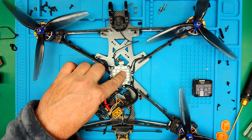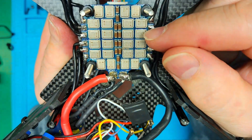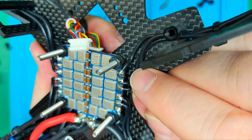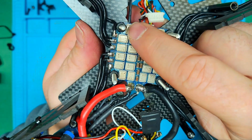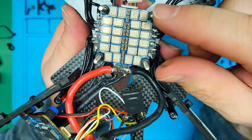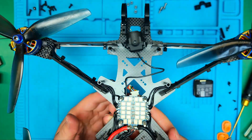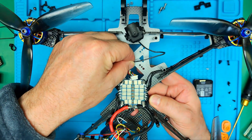I removed the flight controller from the ESC so we could unscrew these nuts and then lift up the ESC. It's a 60 amp ESC. As you can see, there are plastic nuts and that helps isolate vibrations. I have a metal nut underneath that just secures the screw to the frame, then the ESC over it, and then I put plastic nuts on top. I don't want metal nuts because they're very close to the FETs and I don't want them digging in or damaging them. So I opted to go with plastic nuts securing this solidly to the frame, and then the flight controller will follow up and go on here. The reason I loosened this is so I could put the camera cable through here. I've tightened it down and made sure the camera cable is not binding at all — it passes underneath the ESC.